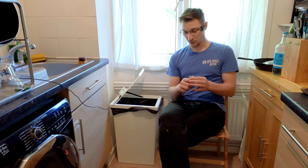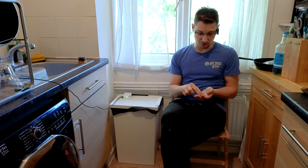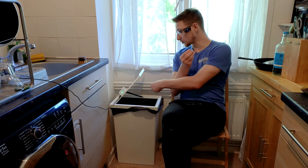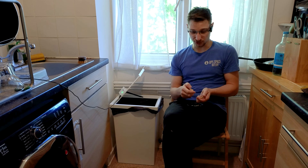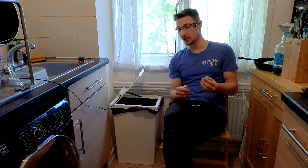I was hoping that would be the end of the project, but unfortunately the window behind me lets in sunlight, which is a problem when you're using an IR distance sensor — it just keeps blasting the sensor so it opens and closes constantly, which is kind of useful in this moment but for the majority of the time is pretty annoying. So I'm going to switch the design to use an ultrasonic distance sensor instead of the IR one.